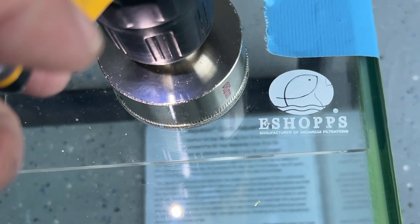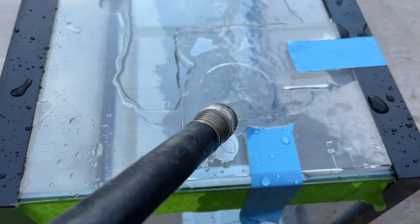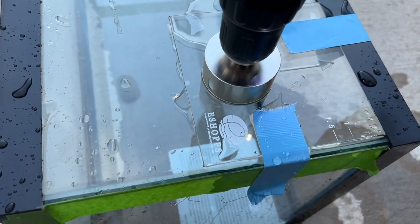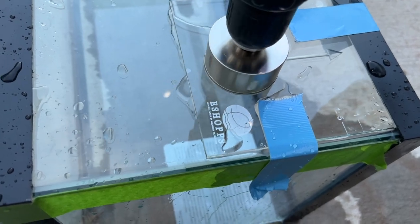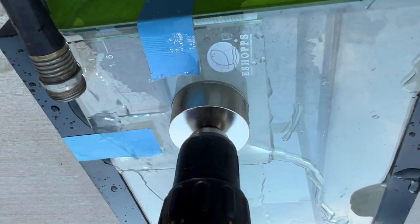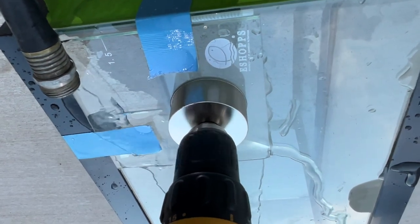Right now I'm just figuring out the spacing. I'm going to use a water hose — they say you could use putty, but really as long as you have flow you're good. I just put a little bit of water, I'm using some duct tape, and going really slow. It's pretty much grinding and making an ugly noise, but as long as you're steady and even you'll be just fine. I'm using the water to wash away any glass the drill bit is making, and once you get grooved in it gets a lot easier. The whole process took about 20-something minutes because I kept taking my time — there's really no rush when you want to do it right the first time.